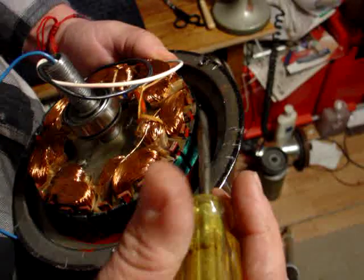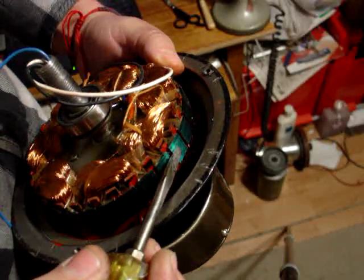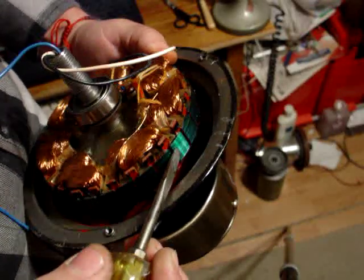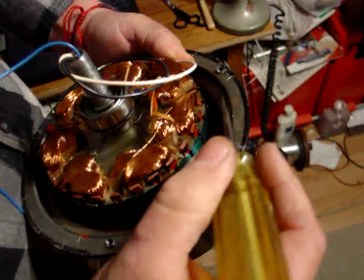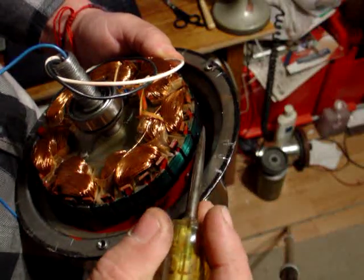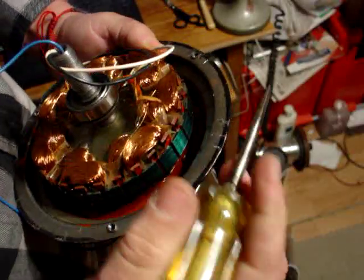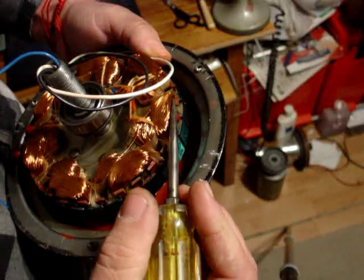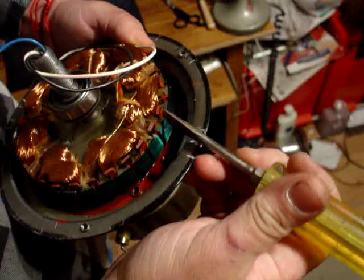These two laminates right here are 90 degrees out of phase, which is why this is over here. With the outside ones, if you start with north, you'd have north, south, north, south. With your induction ring out here and your magnet set against it, you'd have north-north, south-south, north-north, south-south, and as it rotated it would all change. All the way around, a coil from here to here is north and all this is south.